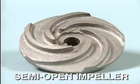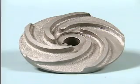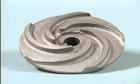Semi-open impellers have one shroud to direct the fluid between the vanes. Semi-open impellers can be used for pumping either thin fluids or heavier fluids and slurries.